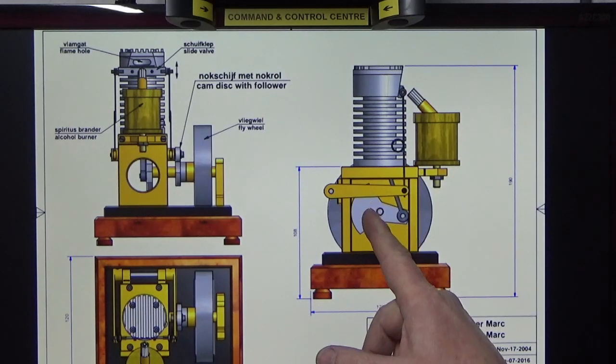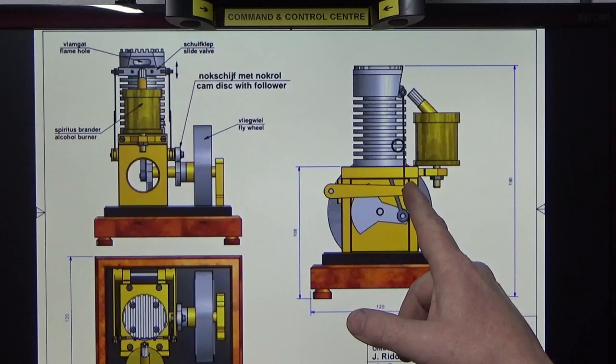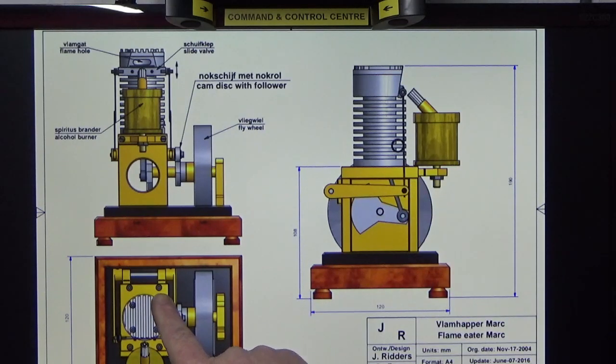The valve lever support brackets, which you can see better on this picture here. So we've got this shaft that runs through the middle into each of the valve lever arms that I've already made, and then there's these 2 brass support brackets that hold that shaft in place. So there's those 2 brass brackets to make there.